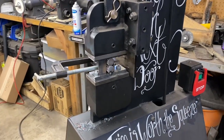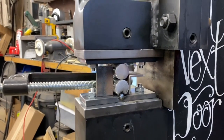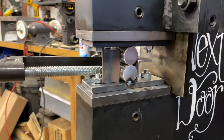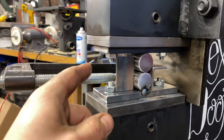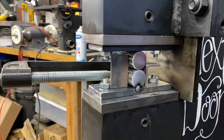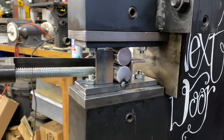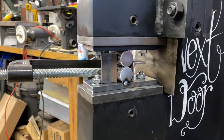Last die is all set up. This one's a bit different — the fullering dies here are the ones that are going to be detachable. I've got these set up in my jig, and the only additional thing I'm going to do is weld up each of these nuts on the actual attachments, so I'll only have to unthread a bolt to change out whatever die I want to put on the blank ones. We're going to get the rest of this tacked up and fully welded.